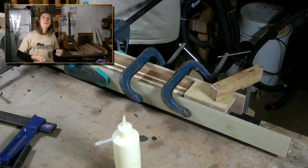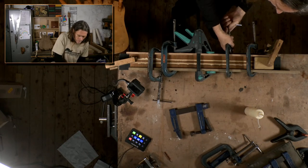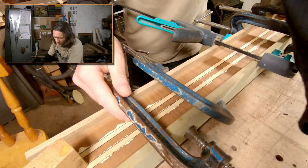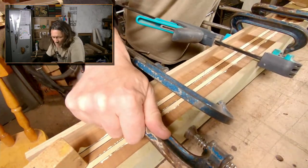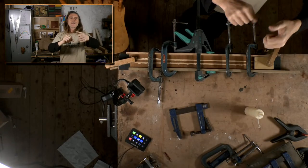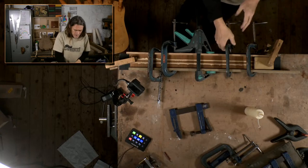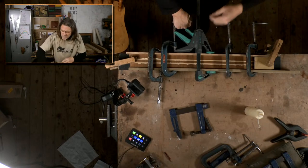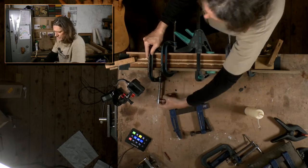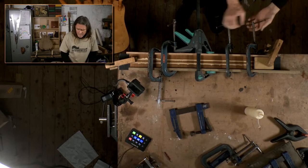It does all look good. So I'm going to go ahead and tighten the clamps. Again, just keeping an eye on it and nipping them up a little bit at a time, one at a time. So the mistake most people make is they hoik up the first clamp too tight, the twisting motion starts it moving, and then it goes downhill from there. So hopefully just take your time, nip them up a little bit at a time, and that whole thing took what, 4 or 5 minutes, if that, and that's it done. And it's not going to move anywhere now.